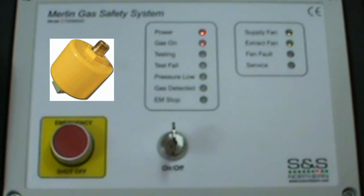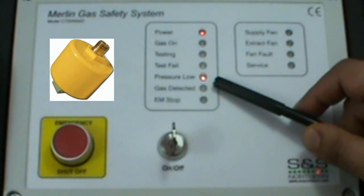The gas pressure sensor monitors the gas pressure all the time. If the gas sensor detects that the gas pressure from the main supply lines has dropped under 12 millibar for more than 10 seconds, the gas solenoid valve will be closed and the panel will indicate that the pressure is low in the pipeline.